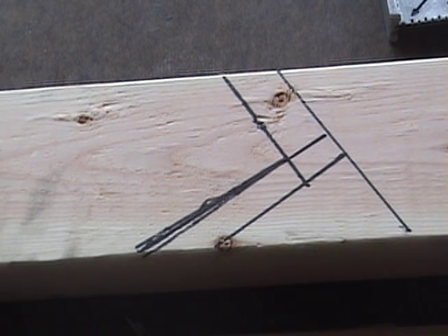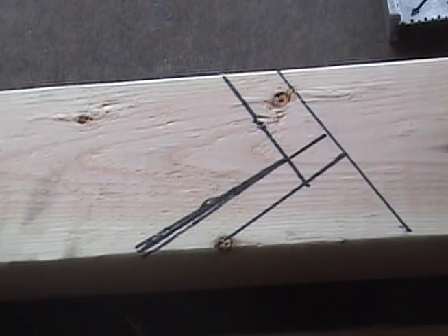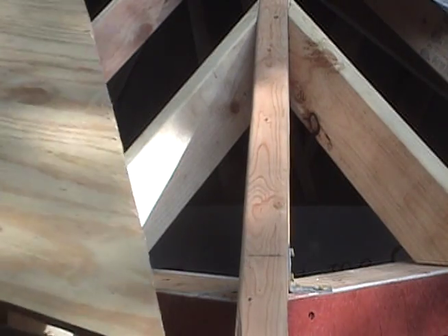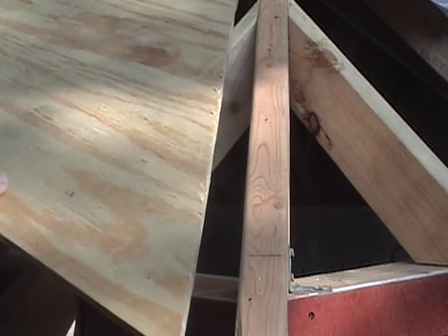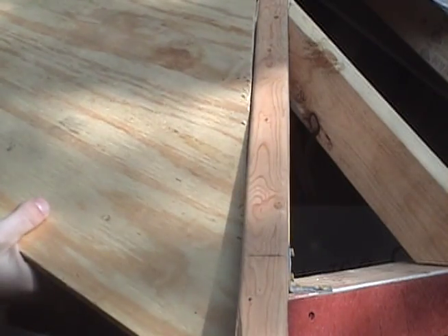When you cut your bird's mouth, cut it on this line and the first plumb line. The reason we had to do that special bird's mouth marking is because we have to drop our hip rafter. If we hadn't made the bird's mouth differently from the common rafter, the plywood we would put on later would bump against the hip rafter instead of sitting on top of it like it's supposed to. So we need to cut more off to make it lower.